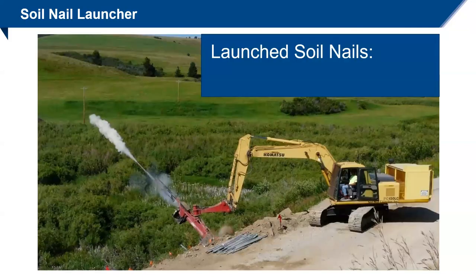Here's a picture of what this device looks like — you can see the exhaust from the compressed air. This equipment was used by the British in World War II to launch nerve gas at the Germans. Sometime in the 90s, the founders of our company found this in a warehouse and said, 'We could treat this like a wood nailer — could we launch soil nails into the ground?' When that bar goes in the ground, it creates a friction bond with the soil. Unlike a traditional soil nail with grout-soil bond, this is just frictional, giving you immediate stabilization. The disadvantage is it's not very strong, but we can launch a lot of these very fast.